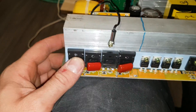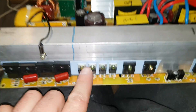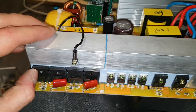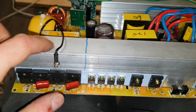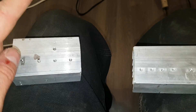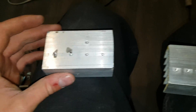I'm having a problem drilling these holes — this fin is right in the way. I tried, but I've got to lift the heatsink up, which doesn't work because everything is bolted in. So I'm going to cut this heatsink, which isn't ideal. With these new IGBTs, I don't think it'll be the hottest point, but the thermistor is attached to it, so the fans will still be controlled by this small heatsink. I cut it in half — not the straightest cut because I had to use a sawzall since I couldn't find my grinder.